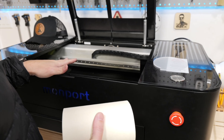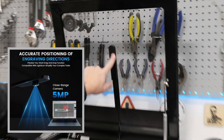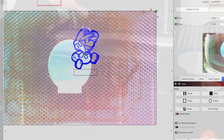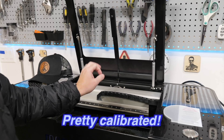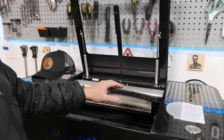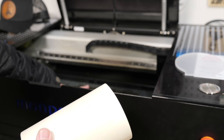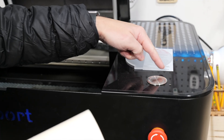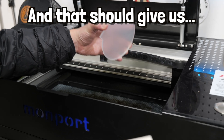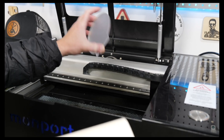What I'm going to do now — because this laser doesn't have crosshairs or anything like that, it uses a camera to pick up where your material is, and then you can adjust your project to where your material is. Though we have it pretty calibrated, it's never going to be perfect. So I'm going to lay down some masking directly onto our bed, then do a light engraving of our design along the edge, and position our acrylic on top of that. That should give us a perfect lineup. This is a good technique if your camera isn't 100% calibrated.